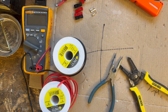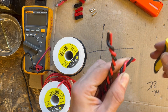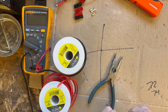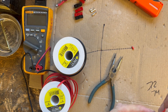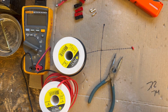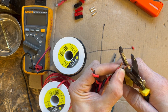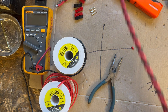Now we've got it all nicely coiled up. The length doesn't matter too much on the ends because we have a messy end — we're going to clean that up. We're going to cut it off and strip about a quarter of an inch off each wire. Get some nice wire strippers and get a nice job on that. I got my soldering iron heated up beforehand, so we're all ready to go.